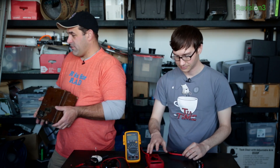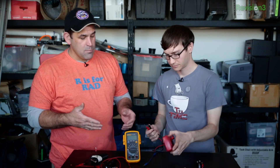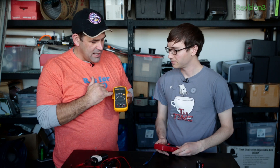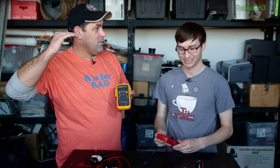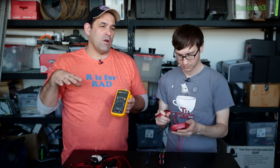That's one of the reasons I bought a fancy Fluke multi-tester. I was fixing my truck and needed something that would tell me the maximum and minimum range a sensor was reporting — probably an oxygen sensor. This one actually will tell you the minimum and maximum, so as it's fluctuating faster than the eye could see, I could hit a button and it would tell me the max. Because the sensor was working correctly, I saw the full range, so I knew it wasn't that particular sensor.